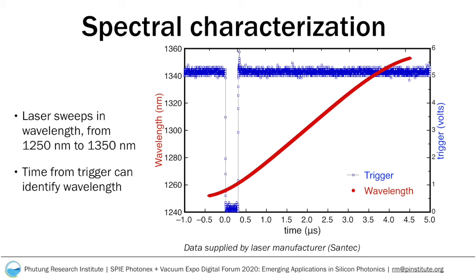However, the data acquisition card has a noise floor in the same order of magnitude as the output measured from the device. In order to resolve the spectral information of the chip, we employ a balanced homodyne detection technique. This allows us to boost the signal from the chip with a portion of the signal laser source.